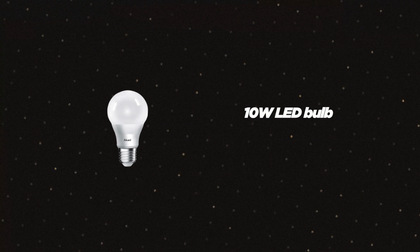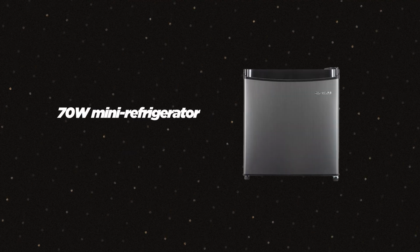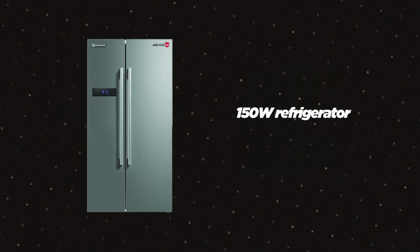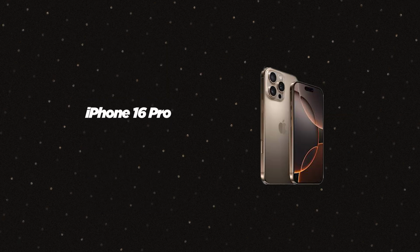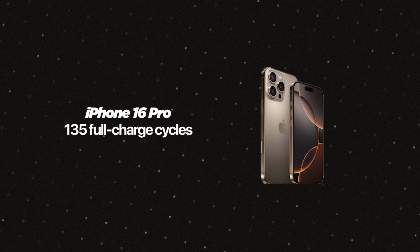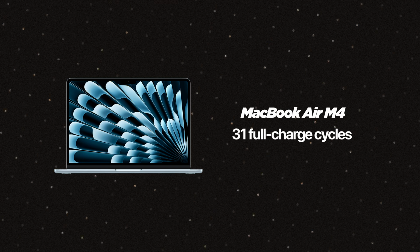We could plug in a 10-watt LED light bulb and that thing would last 180 hours. A 70-watt mini fridge would last 28 to 30 hours. A full-size fridge at 150 watts would last 12 to 13 hours. And with something like an iPhone 16 Pro, you can charge that phone up 135 times on this power station at full charge. And a MacBook Air M4 gets 31 full charge cycles out of this power station.